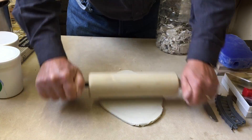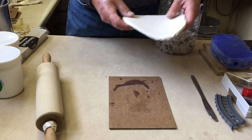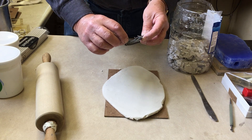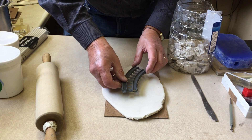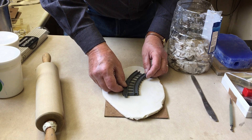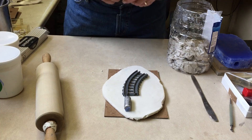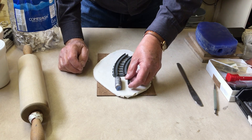Once completed, gently peel it off the table and start preparing it on the underlay board. You need to lay down the track on the slab so you can position it to see how much space you need. There are areas where we will be attaching an ingate, so place it at one side of the slab, not in the middle. We're going to use a pre-made ingate and place it at one end so that the metal will have a place to flow into the mould. We also need a space for the air to be pushed out, and therefore we put what we call a riser at the other side.